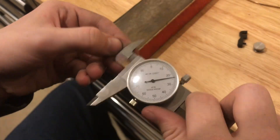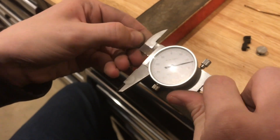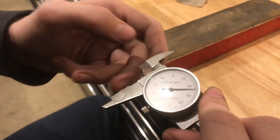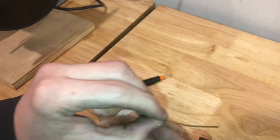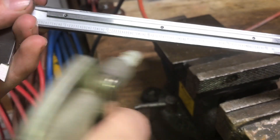There's a pretty good-sized burr right here on the end of the inside calipers — it's big enough I can catch my nail on that. So I'm going to try to grind that away. And that burr is completely gone now. I'm going to polish the tension spring a little bit, trying to polish every surface that's going to be in contact and moving. I'm going to blow the rack out with a bit of air to make sure there are no chips in there.